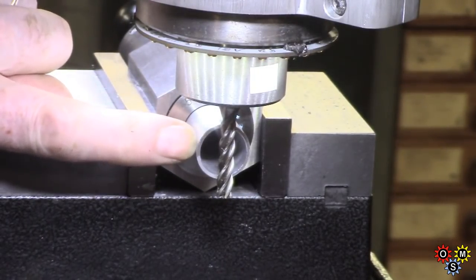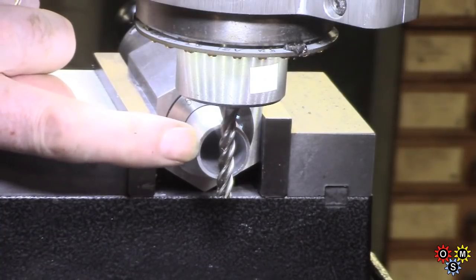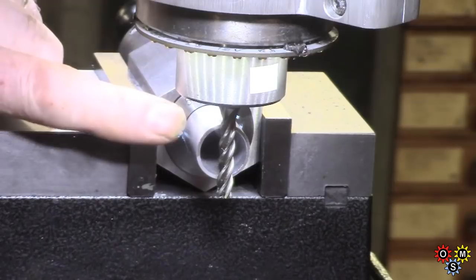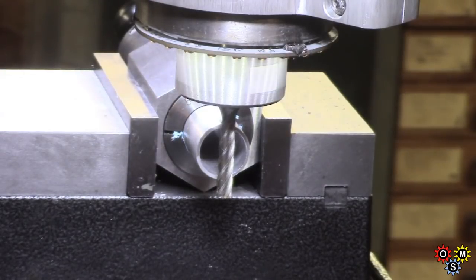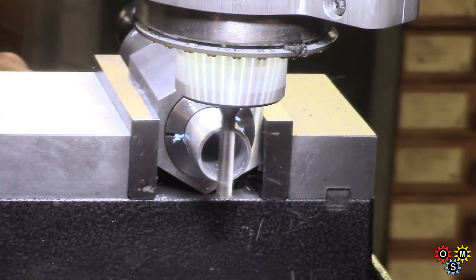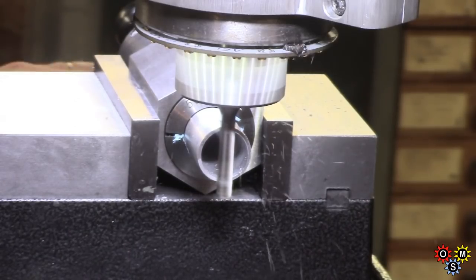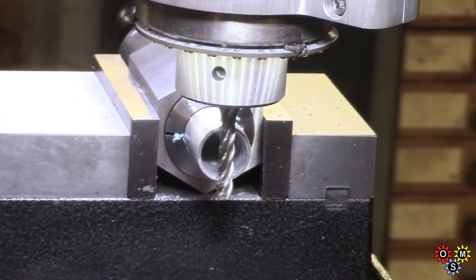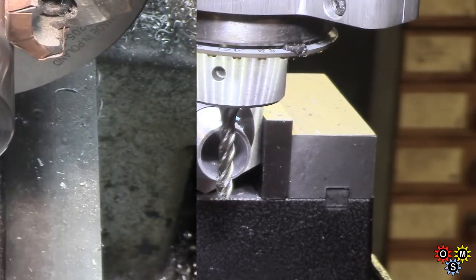Although the tube may not go quite to the bottom of the pot, it still seems wise to put some notches in to make sure that the oil can flow well between the main area and the inside of the tube. Just a quarter milling cutter. Just take some light cuts, just to get a notch done three times.